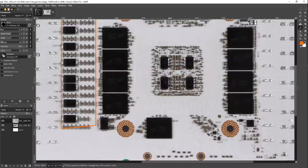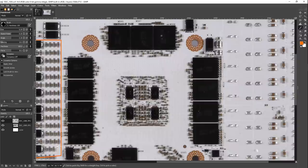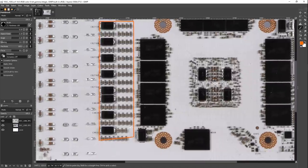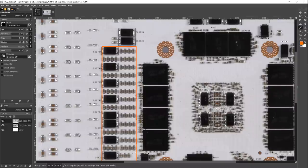That is why I'm guessing they're using the SP caps right behind the core, because it's not a cost-saving thing when you've done this. If this was a cost thing, we wouldn't see all of these multi-layer ceramics right here. They could have very easily just moved those where the SP caps are behind the core. So I'm assuming this is actually an intentional power delivery optimization, maybe for low temperatures. That's an interesting difference between this and the Strix and Kingpin Edition. I'd love to see oscilloscope shots of the Hall of Fame against the Kingpin Edition and the Strix.